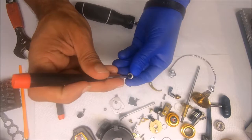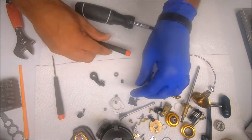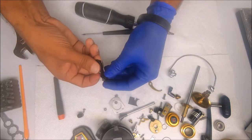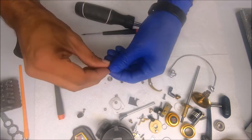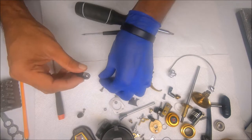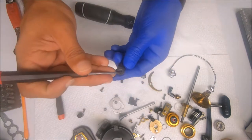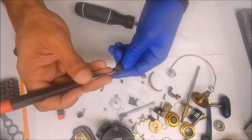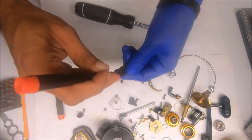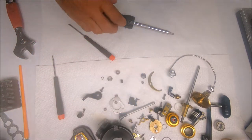It's a good idea to pull out the bushing that's inside the roller just to check it — this one was fine. Sometimes what will happen is the lock washer will get corroded in there and just be stuck. If you are able to get it out, use a flathead screwdriver to clean the corrosion out of there, then add some grease or oil to it when you reassemble it.